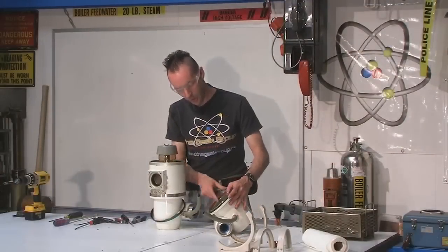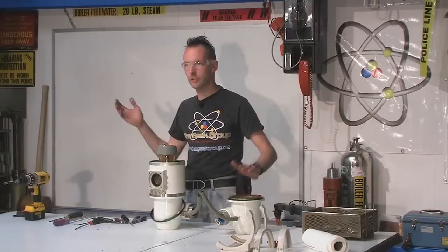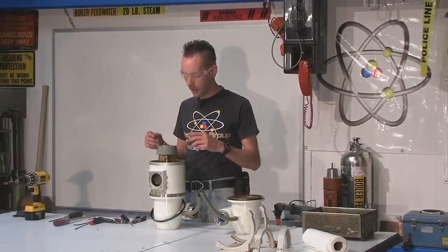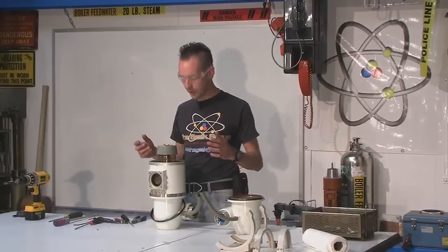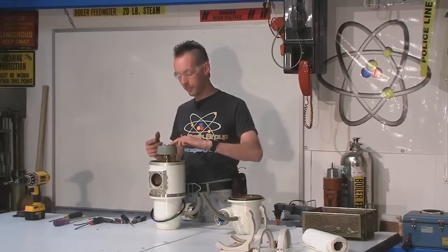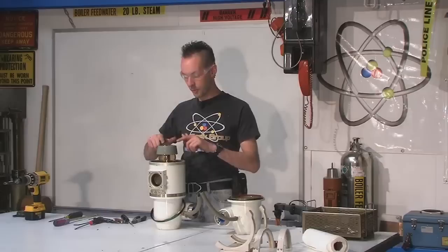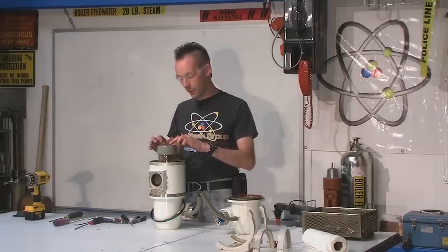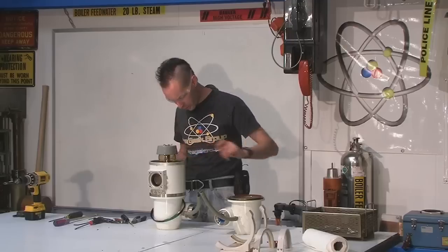The way this works: there are three wires that come down the high voltage cable. They're all insulated from ground at around 150,000 volts, but they're insulated from each other with pretty much no insulation — they pretty much touch. One of these wires — we've got a white, a red, and a black. Let's say the red and black are positive and negative to the filament, so these wires only have three volts between them. But this wire is at 75,000 volts, so from here to here would be zero volts, and from here to here would be three volts — they're all at around 75,000 volts. There's a three-volt high-current charge across there that comes off one of the filament windings. We'll show you that in the transformer when we get back to it.